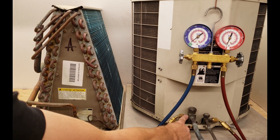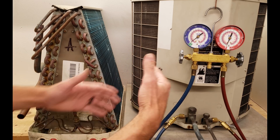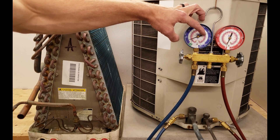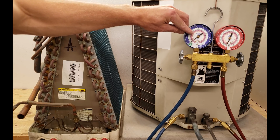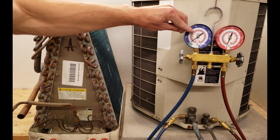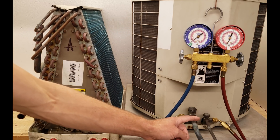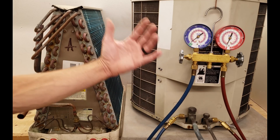When we're measuring the pressure here, we're actually measuring the pressure in the middle of this coil. Say it was R-410A refrigerant and the needle moved up to 120 psig — we bring that into the R-410A inner ring and that's the saturated temperature, reading right about 40–41 degrees. That would mean it's in the middle of this coil. So if the saturated temp was 41 degrees and the line temp was 51 degrees, you take 51 minus 41 and you're left with 10 degrees of total superheat.